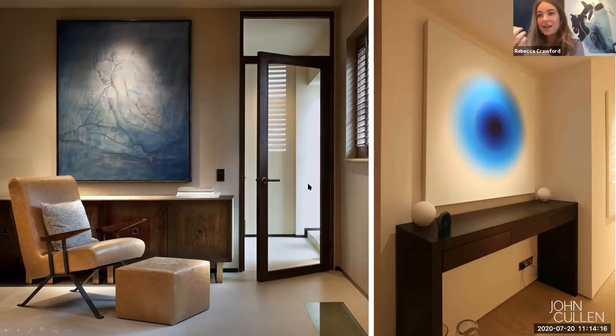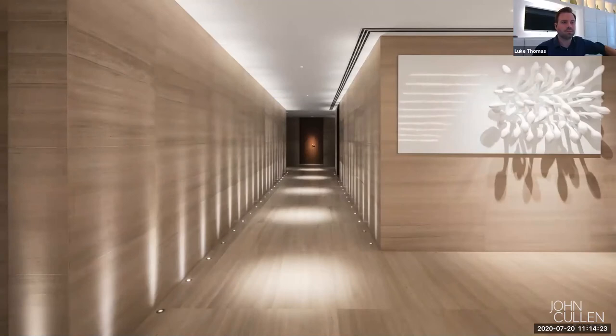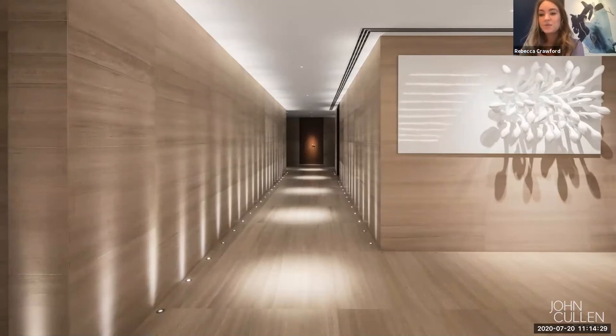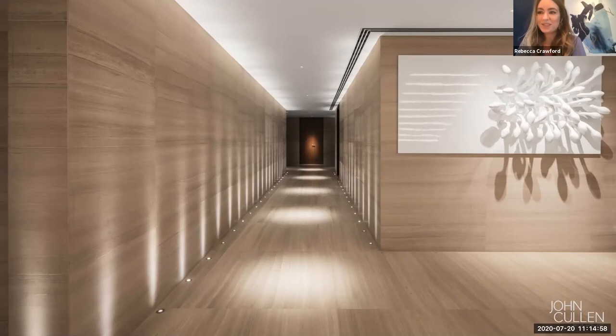It's very easy to talk about downlights being positioned in a way that you can pre-plan, but it's going to take time to plan where your artwork is going, so it must be considered just as important as the rest of the architectural elements. In this project, we knew that the 3D element was going to be positioned in this space, so we made the choice to light it with some cross lighting to really pick up the movement from that piece, making sure to also consider the spacing of the downlights in the ceiling.